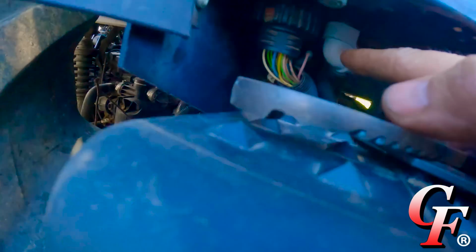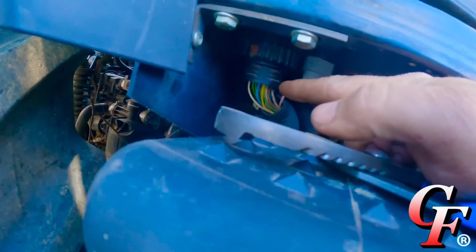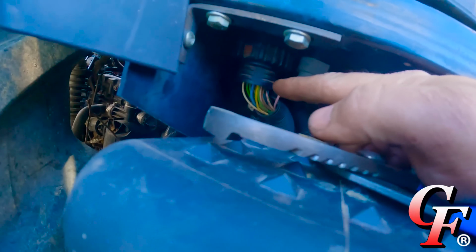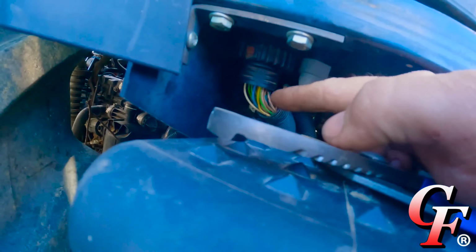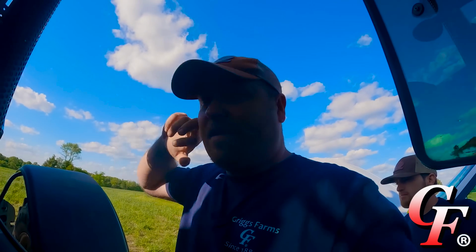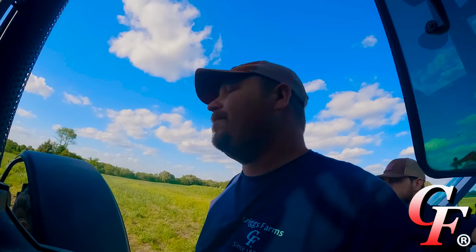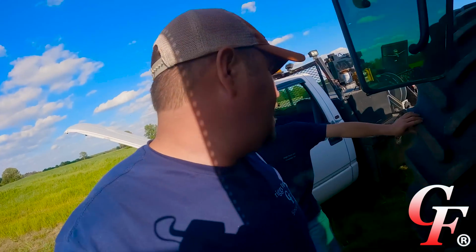Again, the problem was in this wiring harness, the same one that was this morning. The signal wire for the alternator goes through here, and somehow it had gotten pushed way down and was not making connection. Was not making a complete circuit, and therefore the alternator didn't know to start charging, therefore it killed the tractor and everything went haywire. You're back in business. I hope so.